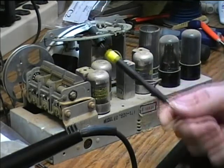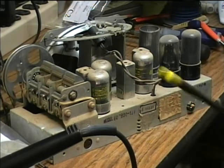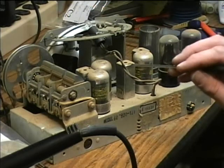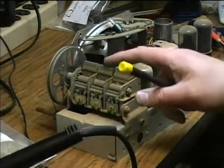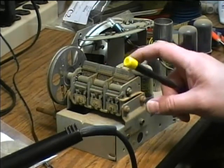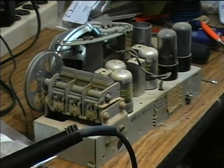The way it works is by mixing together the signal from the station plus an oscillator signal generated locally that is 455 kilohertz higher. You end up with a sum and a difference of the two frequencies, and the difference is always 455 kilohertz. So these IF transformers — which the signal goes through — can be optimized to operate only at 455 kilohertz. That's called the IF, the intermediate frequency. Most AM radios would just have two gangs because they don't have an RF amplifier.